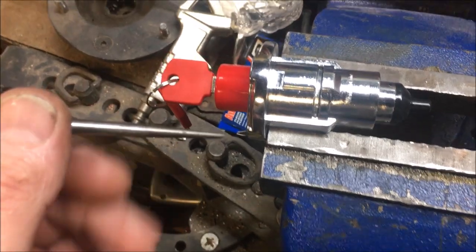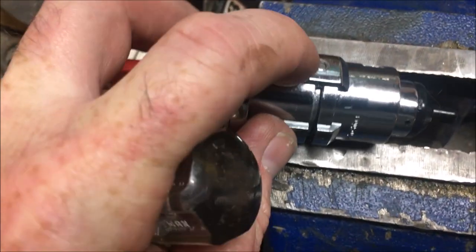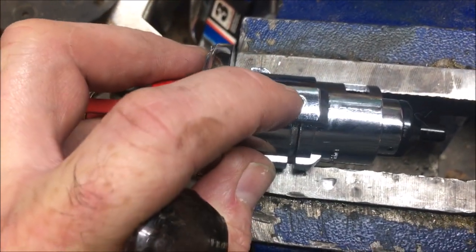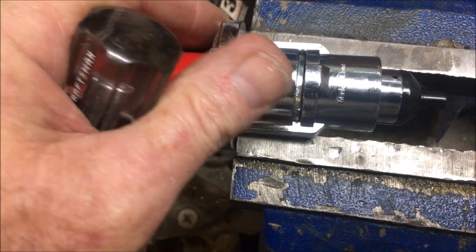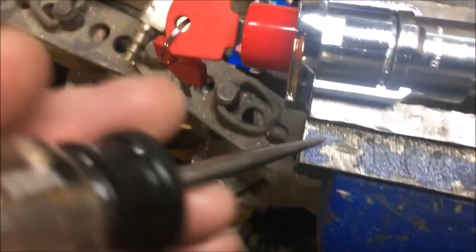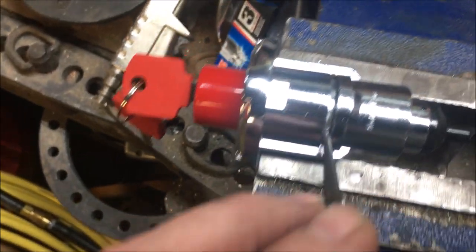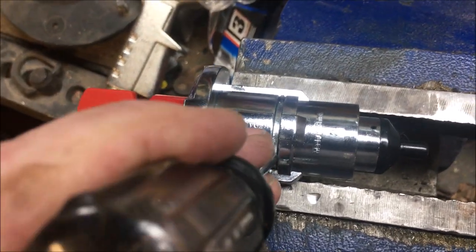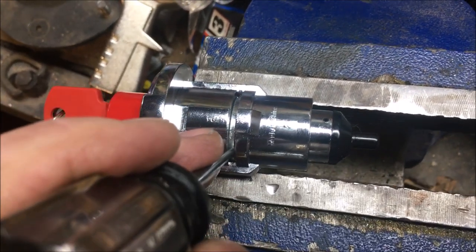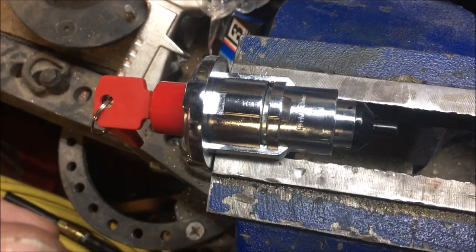You're probably asking, why don't you drill that pin and then pop the ball bearing underneath it? Well, it turns into a mess when you do that. What I do is I take a sharp punch, smack it into it like this, and then I angle it just like you're taking off a shear bolt — and when you push it, it'll actually smack it down.